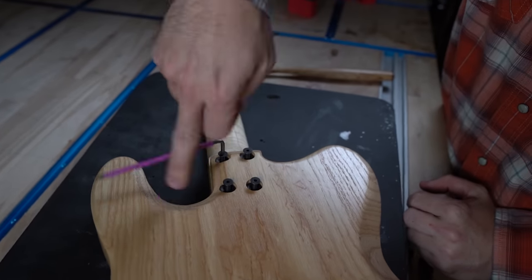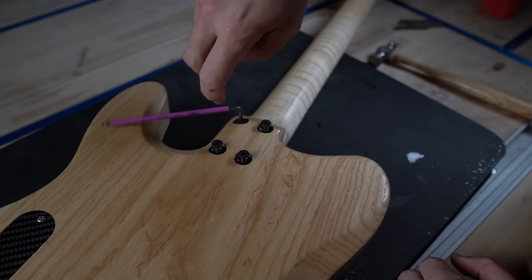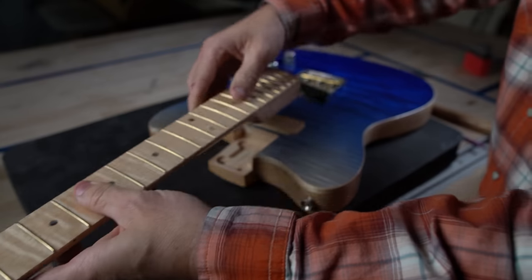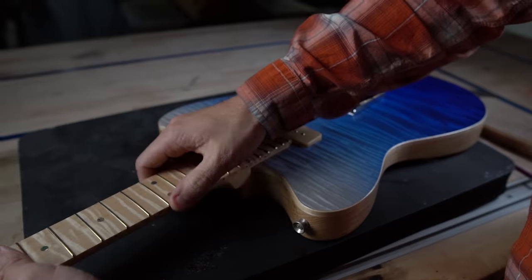And the way that we go about tying all of this together is by, instead of using wood screws, we actually put stainless steel threaded inserts in the neck, and those are all epoxied in. And then we use machine screws and grommets on the body. All of this comes together in this really beautifully machined unit. It just snaps together, and you can tell immediately when you hold a Tidalcaster in your hands how much more connected the whole thing is.